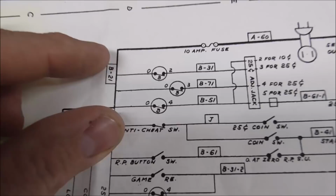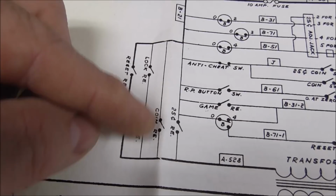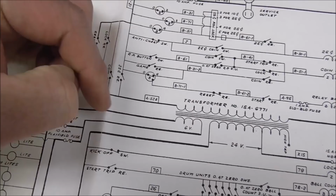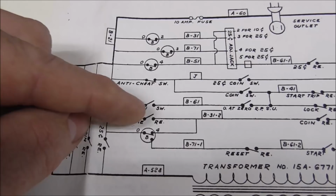So the only way for it to do that is to connect through a switch on the 25 cent relay, a switch on the coin relay, a switch on the lock relay, or a switch on the reset relay. That's the only way to turn on power to the transformer, which is going to turn on everything, right? So what's happening when I hit the start button? Well, when I hit what they call the replay button, I'm connecting the power from the wall, one side of it, through the switch,